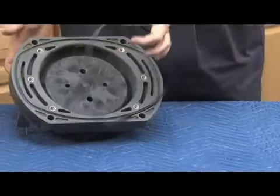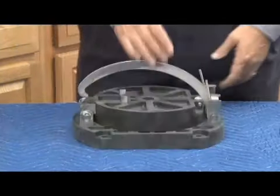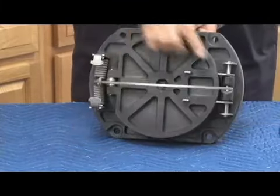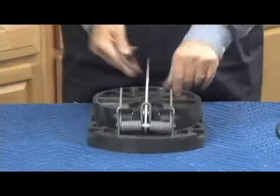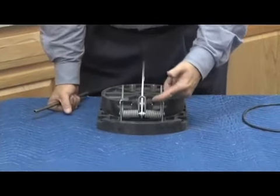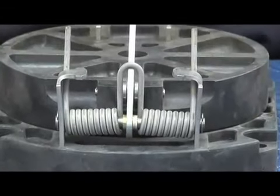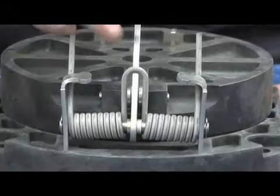Here's where the O-ring seal is. Same things we talked about, O-ring. Make sure it's lubricated properly. We put it back together. But getting this apart, we want to make sure you can get the horizontal cam arm because of the bolts. You don't have to worry about it like you do with the smaller one. But to get this apart, we're going to need to release the spring tension. Now this is what's called a torsion spring, kind of similar to the garage door, where it gets its tension from twisting that spring mechanism. So we have to release the spring tension in order to get this to rotate